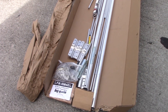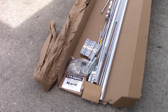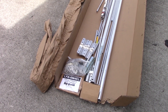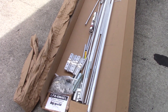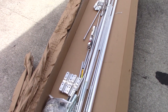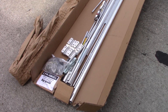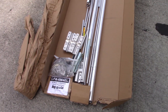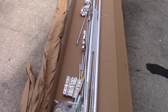What's up everyone, Eric with Ham Radio Concepts. I got another video here - I have a week to get this thing up in the air for the VHF contest on June 10th, Saturday. I've been really wanting to be big on that. You've seen before the video of my Cushcraft 13B2 13-element two-meter Yagi. I picked this up because I need something good for six meters. I do have the high gain vertical that does six meters, but it's a little deaf because the six meter stub is on the very bottom and I don't have the antenna up high enough.